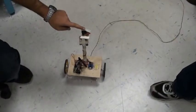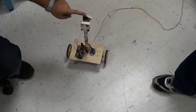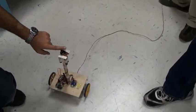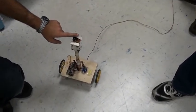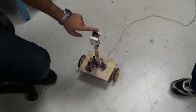That's what we're demonstrating — it maintains control for several seconds without any dampening. With dampening it does better. More weight might also help, but it all depends on PID tuning. We couldn't figure out the right tuning yet, but we wanted to show how it works in principle.